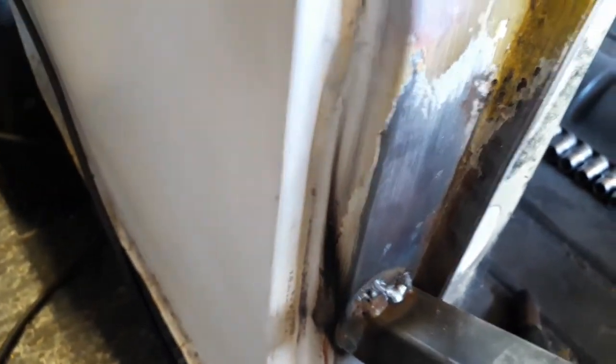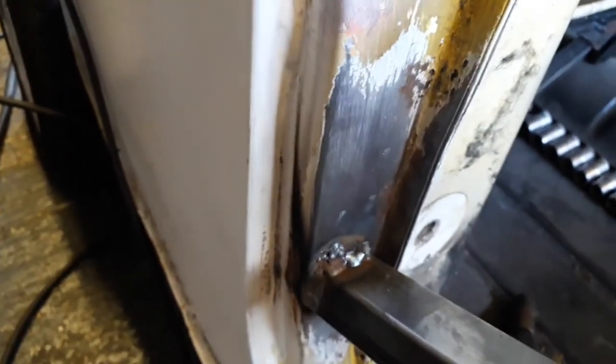I blobbed some weld on top where I blew a small hole in the bodywork and I can grind that back and make it look flush once everything's finished. I'm probably going to leave this video here for today. I've still got the other part of the door bracing to do and I'm going to use my off cuts to brace them into the bracing I've already done. Hopefully next weekend I can finish all the bracing, then start to fully strip the mini, get the front and rear subframes out, and get it into the rotisserie. A little more painting on the rollover jig to do, but that's almost done. Thanks for watching.